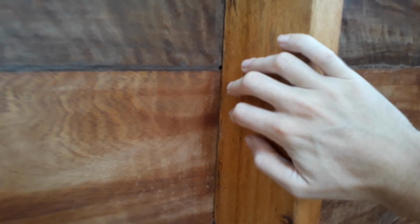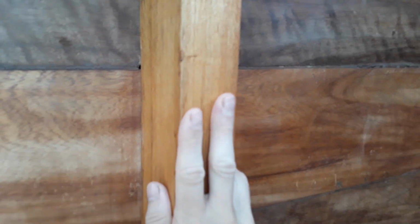Now, the people that did this, unfortunately, the beams, they didn't rub it as well as they should, or it's possible that because the beams were already painted with linseed oil once, they couldn't absorb as much. So either way, it should have been buffed more because there is this very slight stickiness here, but that's not an issue because we're going to deal with it right away. On Monday or Tuesday, we're going to come through with another rag with just solvent on it and rub the stickiness off or sand it a little bit, right?